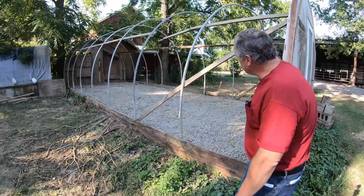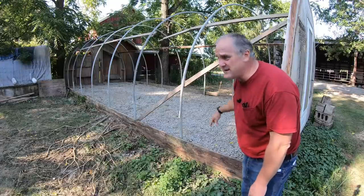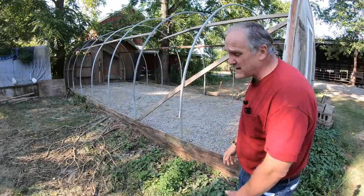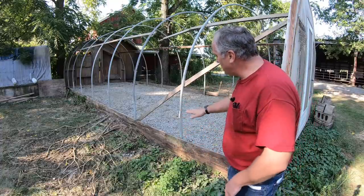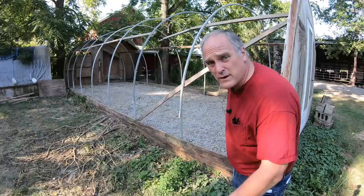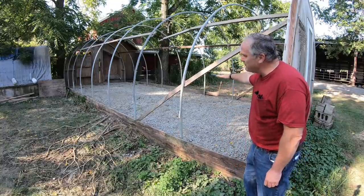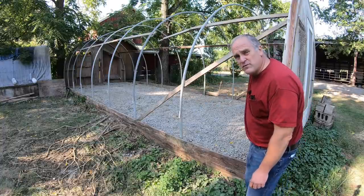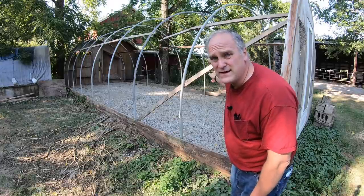The other problem with this house was that the chickens always pecked holes in the plastic. We put chicken wire up six feet on the inside, but when they roosted they would inevitably pick holes, and the rats chewed holes through the plastic too. So the plan is to put in a concrete floor to make it predator- and rat-proof, then run steel roofing panels about three feet up the sides, and above that put in some mesh-reinforced plastic that supposedly lasts at least 15 years.